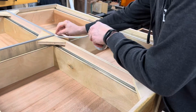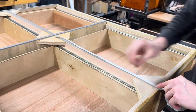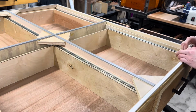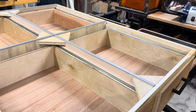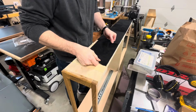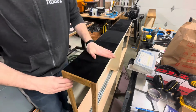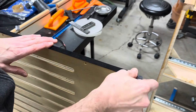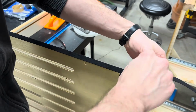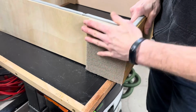Nobody likes a creaky bed, and I went to some extra lengths to make sure that this one wouldn't creak. I used weather stripping to cushion the surface between the drawer base and the platforms that go on top of it. The idea is to prevent any rubbing, creaking, or clicking that might occur between the hard elements of the bed when they're screwed together. The join between the two base pieces was covered with self-adhesive felt for the same reason, as is the seam between the two platform pieces, as well as the edge of the platform piece at the head of the bed where it will touch the wall, and carpet remnants where the bed may touch the baseboard.